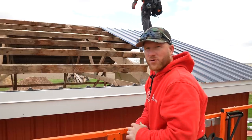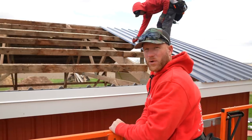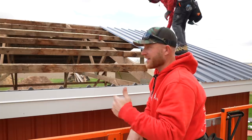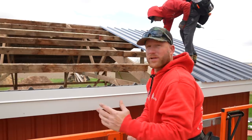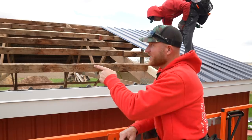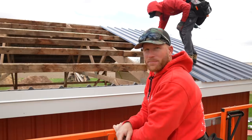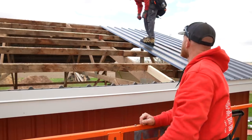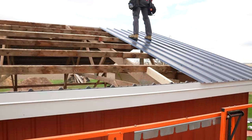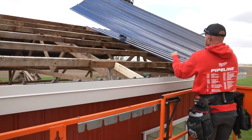I'm not really quite sure what the framer was doing on this original building, but it's definitely a little bit weird because purlins are all over the place. They staggered them. They didn't consistently lap them. So our screw lines are gonna be all sorts of messed up. And we've got our framing that we've added for extra support on some of the bad purlins. So man, the birds are gonna have a field day with this one, Greg. We're gonna get critiqued. Where's Zach when you need him?